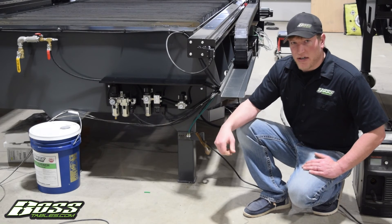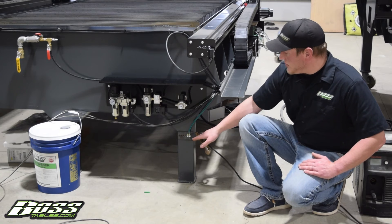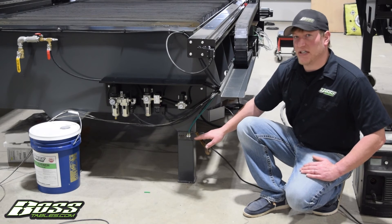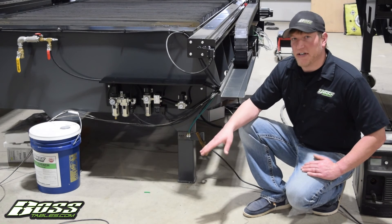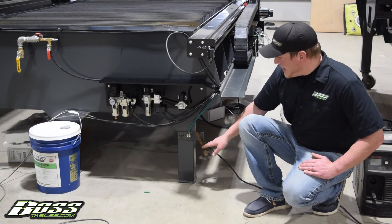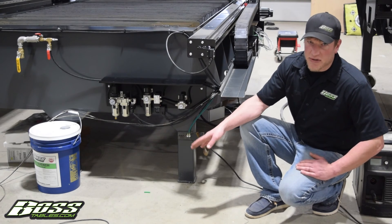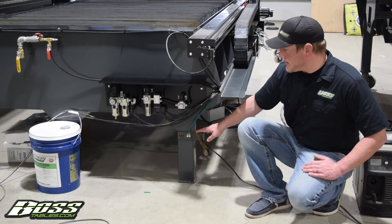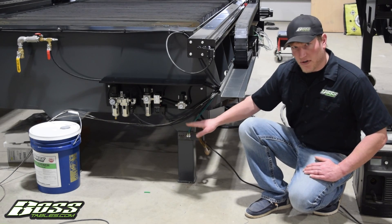You can audibly hear it in the cut — a good ground versus a bad ground. It is absolutely imperative that you do this. Even guys with a PowerMax will see better cut results and better hole quality with proper grounding of equipment. You can move the work clamp to essentially the slats or the material directly — that is acceptable — but this is the preferred location to keep everything at the star ground.